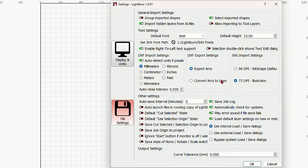And I know that this is positioned perfectly because I'm in absolute coordinates over here. And this is a precision laser. So this is the workbed. The laser will not go off this workbed. It's not like some of the lower quality units where when you put the honeycomb down, it's not in any absolute position. This one happens to be. So we're going to run this in absolute coordinates just like this.